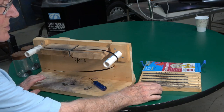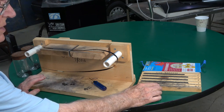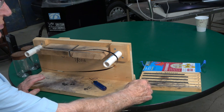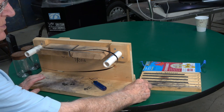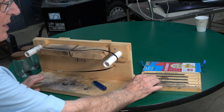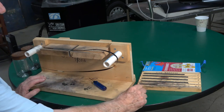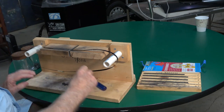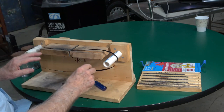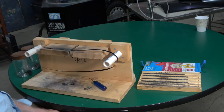Over here is just an arrangement where, prior to starting this process, you can lay out the type in the sequence that it's supposed to be in, whatever you're building. Typically on the standard band, there are five arrays, 1, 2, 3, 4, and 5, of 48 characters, essentially duplicates of each other. And they simply go in, butt all together, and with those five arrays on there, you have a completed band. Good luck.